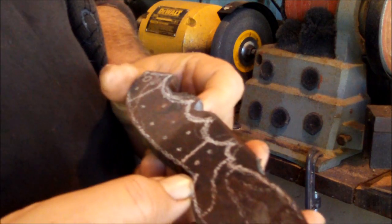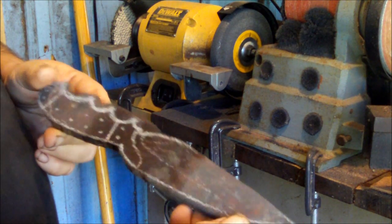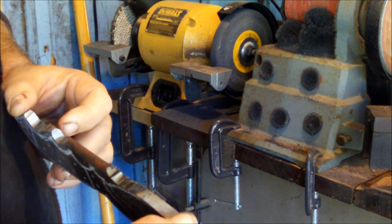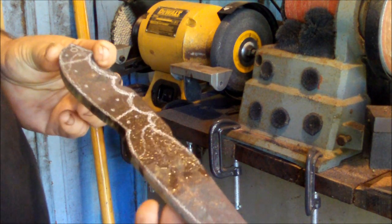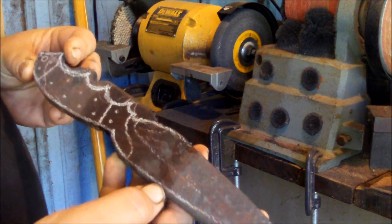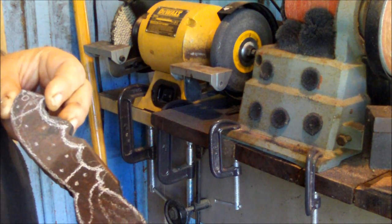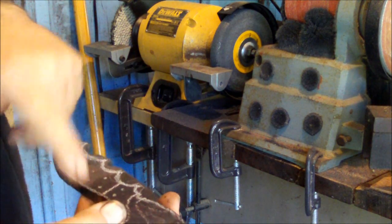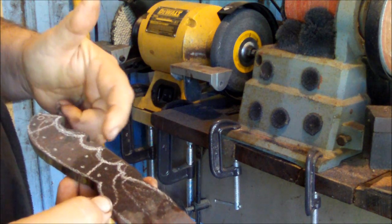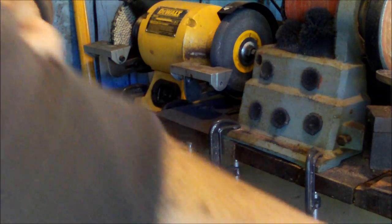Okay. What I've done since I talked to you last was I have the blade drawn on the piece of steel, which is 5/16 thick, pretty thick. Gonna make a real hefty knife. 5160 spring steel. What I'm doing is I used a hacksaw, and I hacksawed part of it off, a portion equal to this, and now I'm using the grinder and I'm slowly grinding the shape of the knife, and then I'll start grinding the blade. So this is going to be loud, but I'll let you see me grinding it for a minute.